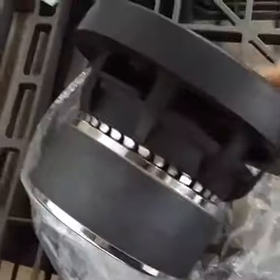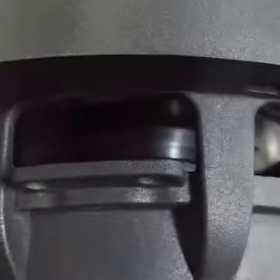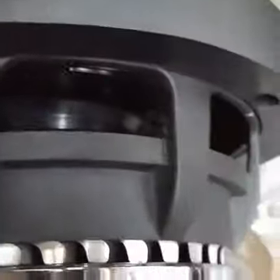All the cooling channels in here. So you've got the spiders going up to the former. The former goes into a carrier, which goes into the cone. If you had the cone angle all the way down to the spiders, this thing moves so much it would just smack the spiders. So it's spaced off — the thing's got clearance.